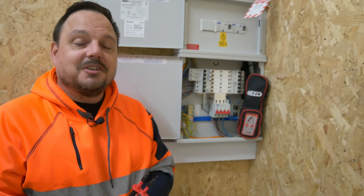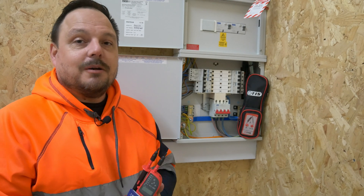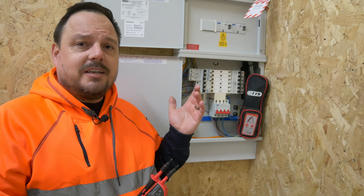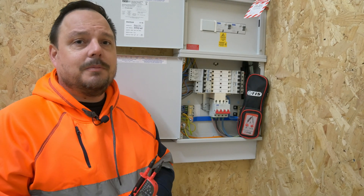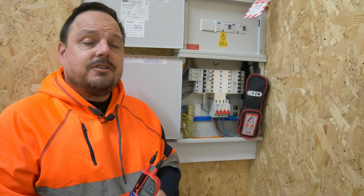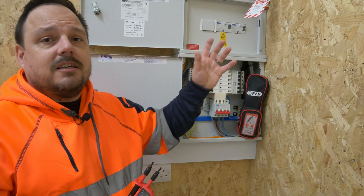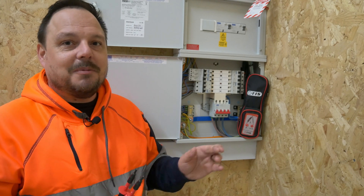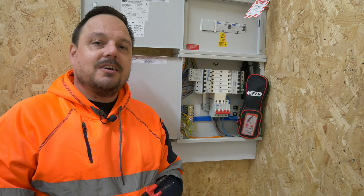I hope that video was useful and it's provided some content that might help you. It is quite a basic principle but it's one of the founding things that we're all supposed to understand and work within out doing the day job — making sure we're keeping ourselves safe and we understand when we are live working. There are people who will share content suggesting young electricians are out there working dangerously inside distribution boards all the time. Obviously raising awareness and the discussion around all of this is important, but let's not demean and belittle other people just for effect and attention. It's about encouraging a different and safer way to work at the end of the day. Carrying out a safe isolation is no real hardship — it's easily done. Just ensure that the thing you're working on at the end of that circuit or piece of equipment is actually isolated and that you run through the process of checking. I hope you've enjoyed the video — if you've got any questions, drop them in below and I will see you on the next one.